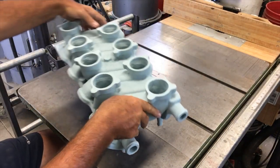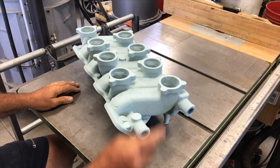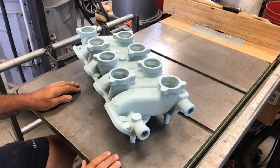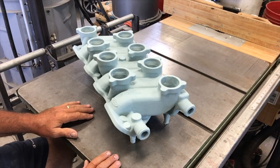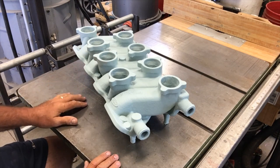They tend to be a little wetter just because of the relative humidity. The vapor pressure from the wet slurry evaporating in there raises the vapor pressure, and it just doesn't dry as quickly. So it's probably dry enough to pour right now everywhere, except I'd be a little concerned about the interior runners.